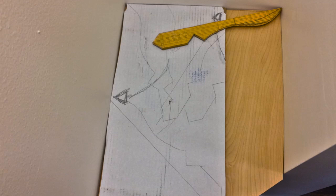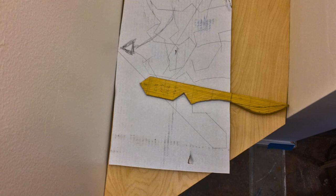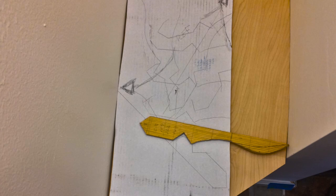Now it's just a matter of placing the point of the stick in multiple positions around the space, tracing it as I go. The more positions I record, the more accurate my shape will be when I transfer it to my shelf blank. However, the more positions I record, the more cluttered with lines the cardboard will be. To keep the lines from getting too confusing, since this stick is kinda goofy and big, I didn't trace all the way around it, just the one edge with the S-curve and the notch.